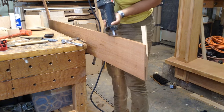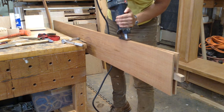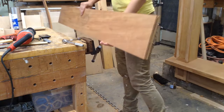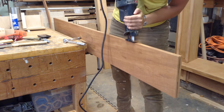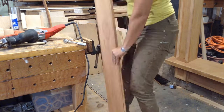I cut this in half, but the board was about eight inches wide and my saw only does six inches, so I was left with a little bit in the middle. I started using a hand saw but it got quite tedious, so I switched to a saber saw to remove the material in the middle. You're only going to see one side of this board, so the inside edge being a little rough was fine — I just sanded it and it worked out nicely.